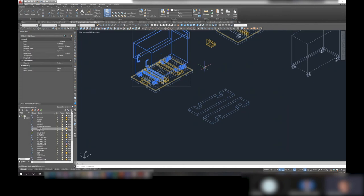Sometimes the machine nameplate, the machine number plate, all the blah, blah, blah, they will stencil or engrave all these things. Especially the nameplate: what year they built, what weight is the machine, where the product comes from, maybe German, maybe Belgium, who knows? But the weight, they state that. To have that type of information is the best, because based on that, you can calculate.